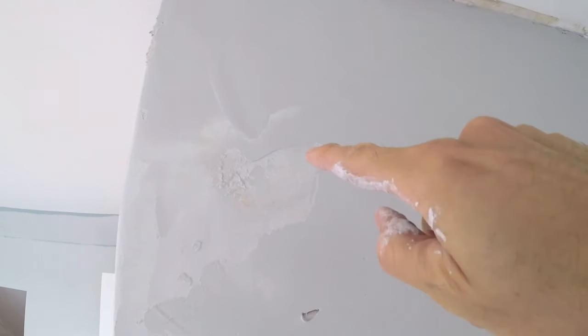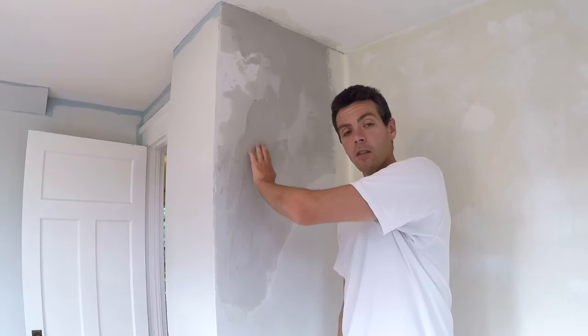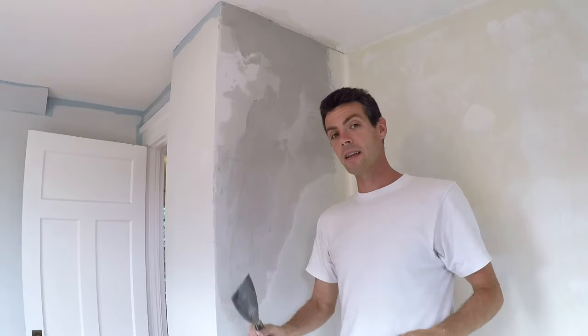Let's get a look at that. I've got a hole up there that I couldn't quite fill, and some stuff that needs to be knocked down. There's that big bulge right there where it sticks out way more. I left it a little bit above the edges in a lot of cases. This is mostly set up — it's taken a long time, actually. I think I added a bit too much glue. So as a rule of thumb, I would not exceed a 1-to-10 ratio mixture — so 10 parts water, one part glue.